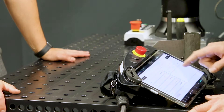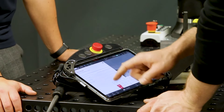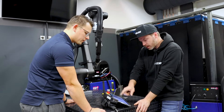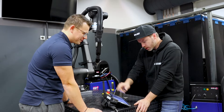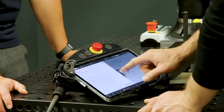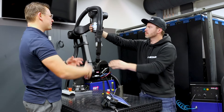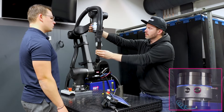I would start with deleting the product from the work order. Now you can start with 'Add Product.' Get a product name — I'll call it Triple A. Close. Next, because we don't need the other fields. Select the torch — it was the 22-degree W500, correct. That's the angle from the torch. Process — regular welding, standard. As we're not welding today, you can choose everything. Gas — 20% CO2. Materials — steel or steel filler. Wire diameter 1.2. Next. Now I'll choose the starting point. I would start by releasing the button — you can feel that one button sits a little more outside than the other. Now the axes are released and you can move the robot.